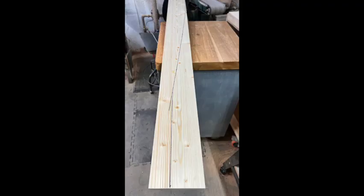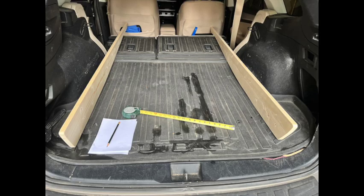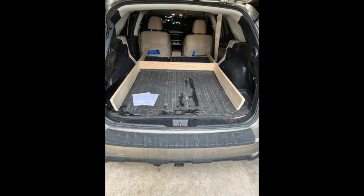Then it was a little bit of work with a bandsaw — or you could use a jigsaw — to cut the slopes on both sides. Now these are clearly level, but there is nothing to keep them from falling over, so I cut notches somewhere near the middle of each one and put a cross piece across. Those interlock together without any hardware and keep it all standing up straight and strong.